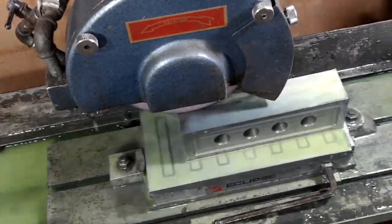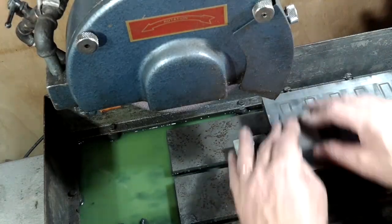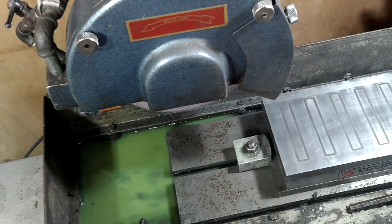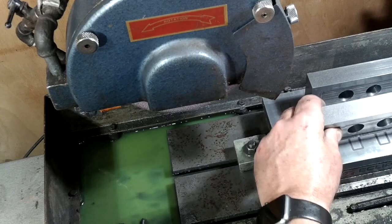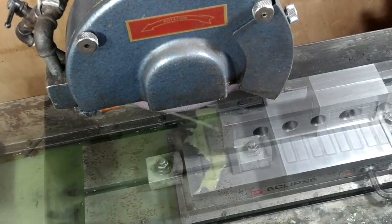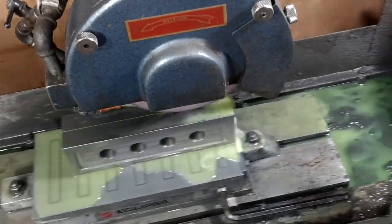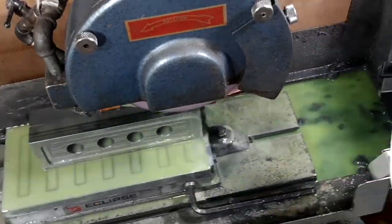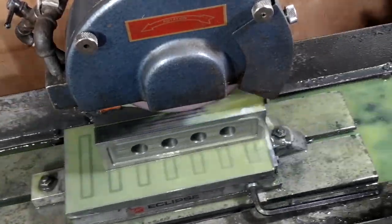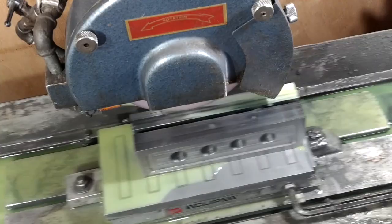Again the allen key switch is in the release position. In this position there is almost always a little residual magnetic attraction — enough to hold some types of workpieces but not all of them. The longer and wider the piece, the better obviously. Once the top face has been cleaned up I removed the material to turn it the other way over, and before putting the material back on the chuck I used a precision stone to clean the mag chuck's face first. Then the material can be put back on the magnetic chuck with full power switched on. After this operation was completed I redressed the cutting wheel with a medium dressing, to allow me to finish cut each of the top and bottom faces with a fine finish.